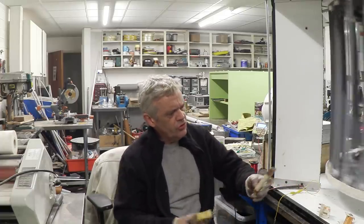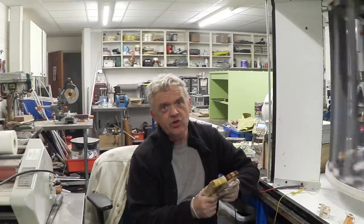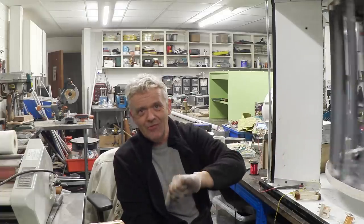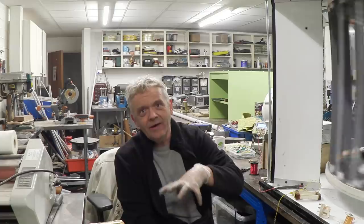Now, they do work, actually, without a magnetic core at all. Now, with a magnetic core, so if they're popped back onto this steel, then the minute I put them under load, there's quite a slowing down. This goes from 10 RPM to about 5 RPM, and that is the reactance, obviously. Now, you do get the power out, but obviously what you're doing is giving up the rotation, which means that it needs more energy to put in because you get more energy out. Remember, no free rides.